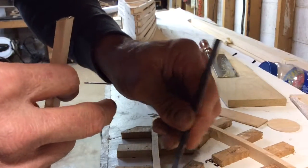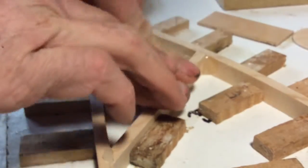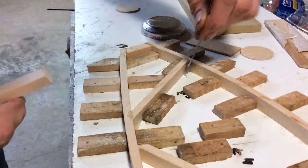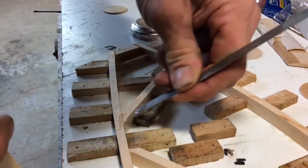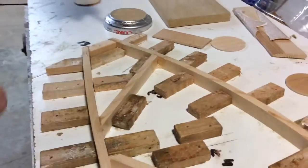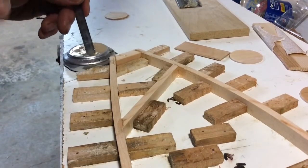I'm just using a little metal scale — it's flexible and flat and gets right in there, making a great little glue spatula. Once again, you see some squeeze-out there. If you don't see the squeeze-out, you know you didn't have enough glue. This T-88 is a very strong product. I did some tests on it — glued up some spruce scrap pieces, let it cure overnight, and tested the joints. They all failed, but the glue didn't fail. The wood grains came apart before the glue failed, which is what I would have expected.